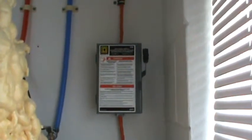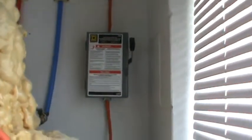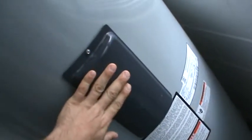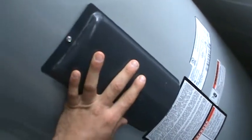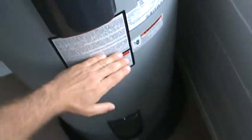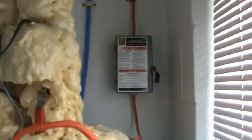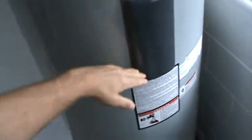That allows me to actually get a better solar fraction out of it during the summer when I know I have plenty of heat. It allows me to fill up the entire tank with solar heated water and use every last bit of it without relying on the electrical backup element. But if I have guests coming over and don't want them to have to flip that lever, I'll turn it on, and that way if the water level is consumed we've still got about 30 gallons supplied by the electrical element. Most of the time that switch is in the off position and it runs completely off solar with no electrical backup, giving me an extra 30 gallons of solar heated water.